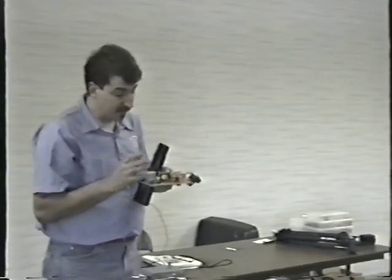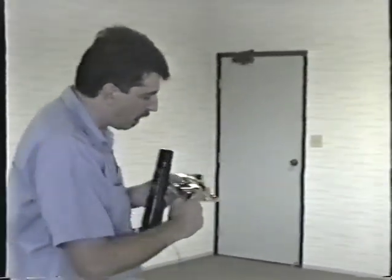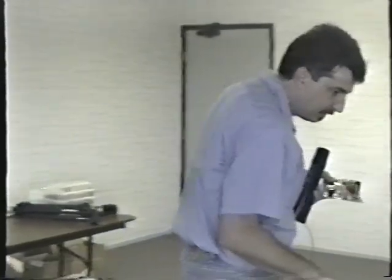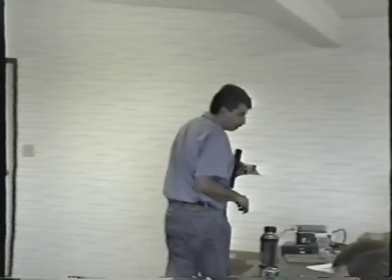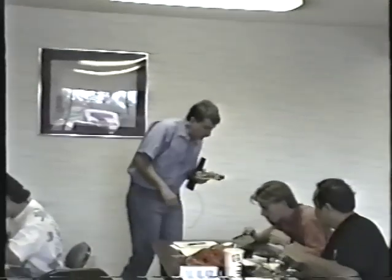Check the clamping diodes. And let's see if we can find these things. The clamping diodes are always right in front of the transistors or immediately behind, depending on the model. You see your two clamping diodes right there? You see yours, Dan? Yeah. Right in there? Okay. You got yours, Tony? Yeah. Seeing those two right there. You see them, Dustin?